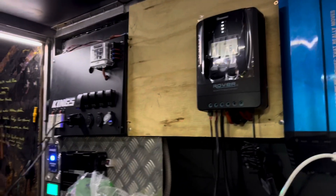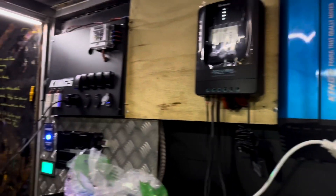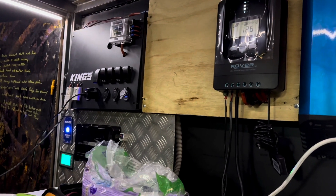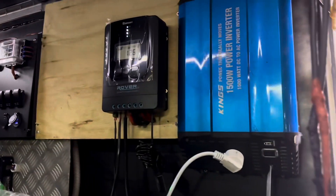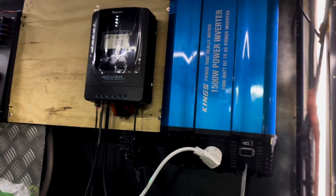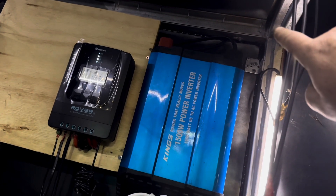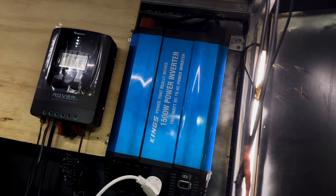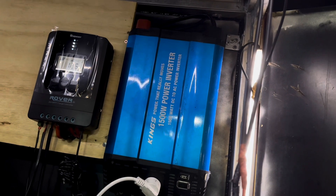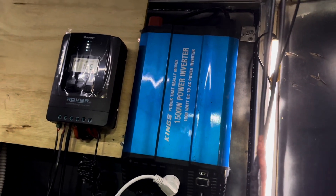For the last hour and a half I've been debugging what turned out to be a ground wire issue. I've got the output from the solar controller running to the control box, which seemed to have some ground interference from the inverter. What I ended up having to do is run the ground just above the inverter — it's bolted into a steel frame — and then I've got another ground for the battery to the steel of the trailer.